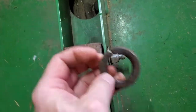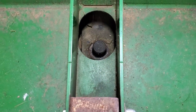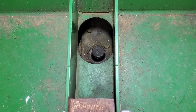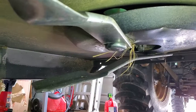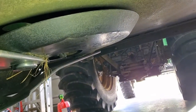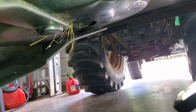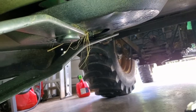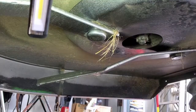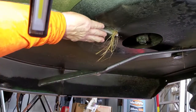So there's the lock washer, and then there's the bolt sticking up. So what I'm going to need to do maybe is get something and tap on the top of that bolt — or maybe even pound on it — to get the blade to come out. Let me take you underneath. Here's the blade and you can see the nut there. It may just fall out — let's see if I can wiggle this. Let me set you up on the tripod and I'll see if I can just wiggle it, and it may come out that way without having to knock it out from the top.